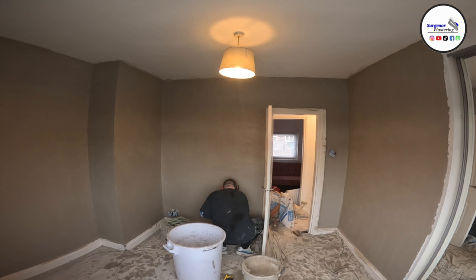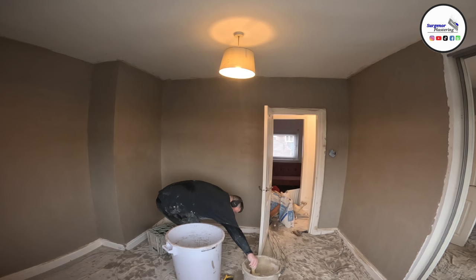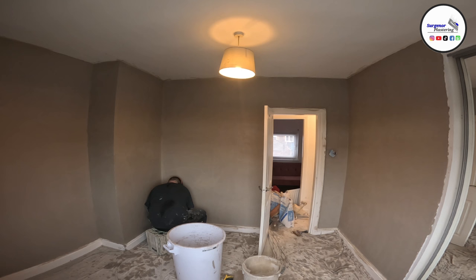And what I do is I agitate. It's sort of like sponge floating for the guys that do that. But I'll agitate the plaster with my water brush. And again, the water brush is a horsehair 6-inch brush. Again, you can get them from O'Neill's or previously Rambo Tools for the guys that notice that. They'll be linked in the description.